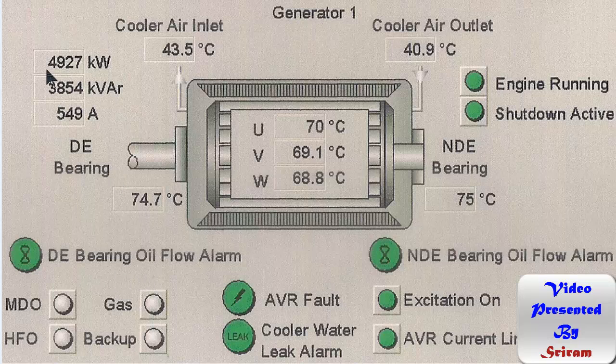The parameters include the kilowatt load, the KVAR (reactive load), and the amperes. Most marine alternators are rated for 440 volts and we can typically read only the kilowatt load. KVAR is not monitored in ships without high-powered propulsive loads. On this ship we had electrical propulsion, so both kilowatt and KVAR were monitored, as a synchronous motor was used. Amperes will vary depending on the load.